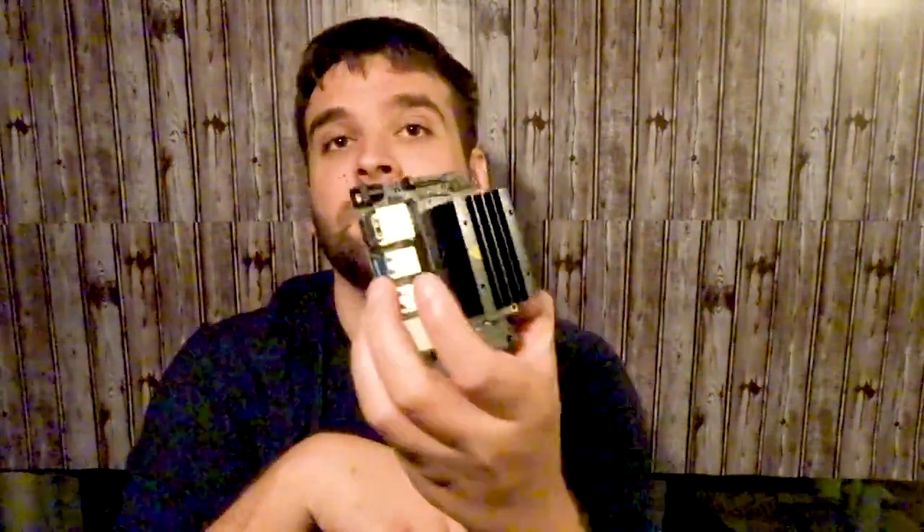The size, simplicity, and voltage range of the LM2596 really is great for people that are just getting into robotics, microcontrollers, and coding. This buck converter is perfect if you're trying to take a high voltage and convert it to a low voltage so your microcontroller does not make some magic smoke. The LM2596 is not for every application — you're not going to really hit the limits of this converter unless you start working with computers like a Raspberry Pi or the Jetson Nano like what's in Wolfie.